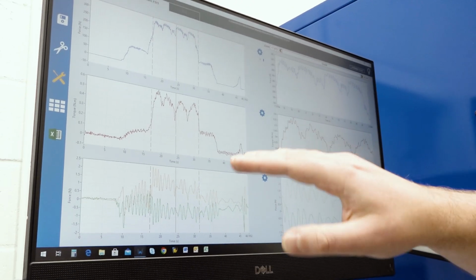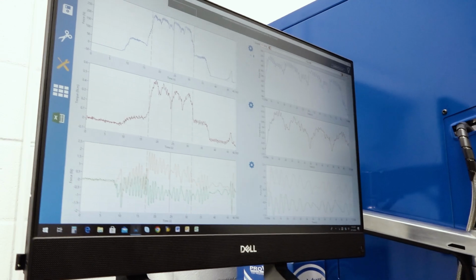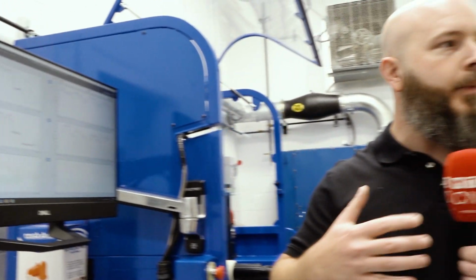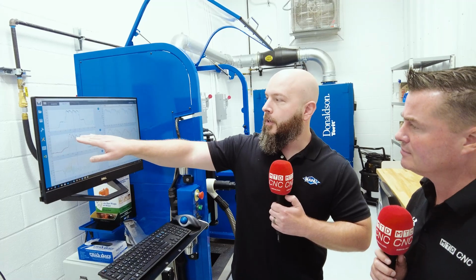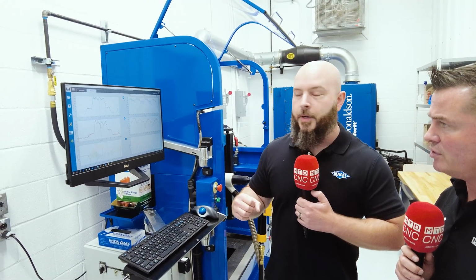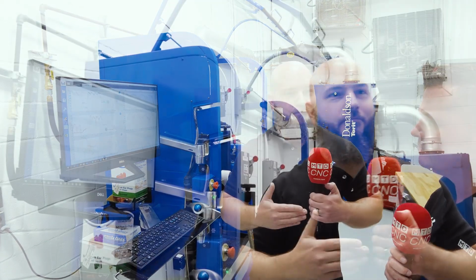Now, what we might see is after we get past 100 holes, for example, maybe the titanium is starting to work harden. We will see the torque increase the deeper you go into the hole because it's starting to squeeze onto the diameter. Of course, yeah. So that also helps us fine tune the tool to meet the goals of the customer as far as tool life goes.